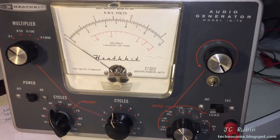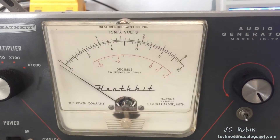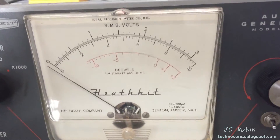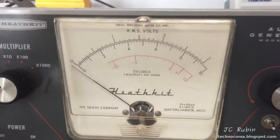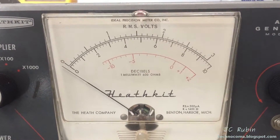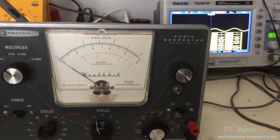It would be a good idea to test the meter itself — make sure the sweep is good. When I put an AC voltage through it, it reads RMS volts, so AC is expected. I'm not going to impedance match; I'll just make sure that with a low enough AC voltage I can go from zero to full sweep and back. First, I'm going to set the true zero of the meter and tap it a few times to make sure it's okay. Then I'll connect everything up and turn up the voltage to verify the meter is working fine.